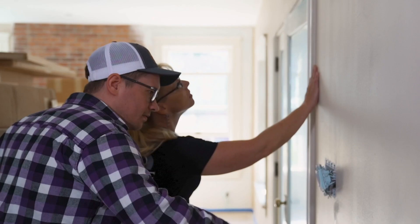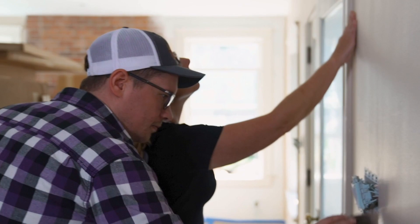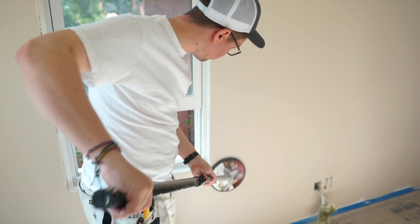Normally what we do when we come into a paint project is we will come in and evaluate the job, check the walls. We'll go through and skim coat certain areas if there's divots or dings on the wall, then let that set up, go through and sand those areas.